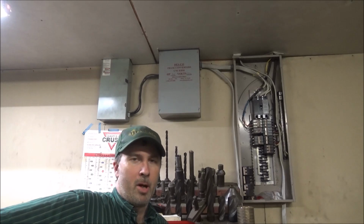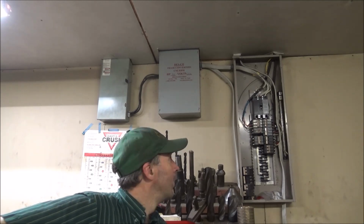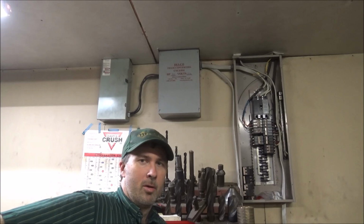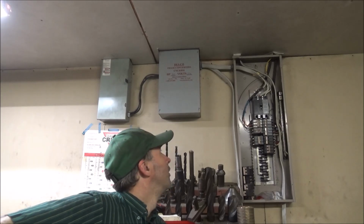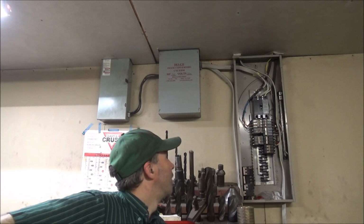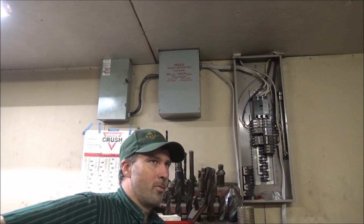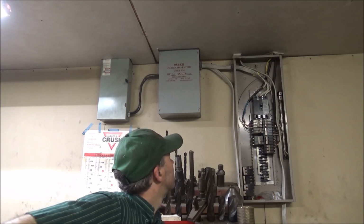Well, fortunately, solving that problem wasn't much more than some basic maintenance, going in and cleaning up the electrical connections and getting rid of the melted plastic that was insulating the phase and causing the no start condition. That phase converter is one of those cheap old jobs. I got it off eBay a long time ago, it's been over 20 years. And you can see what you get for, I don't remember what this thing was, just $1,500 I think back then for a 30 horse.